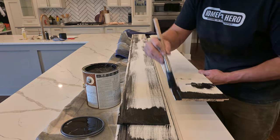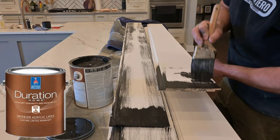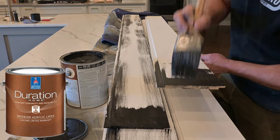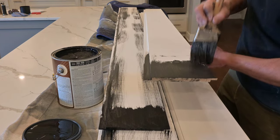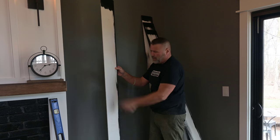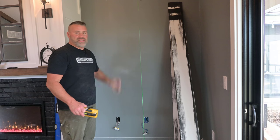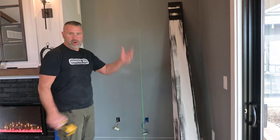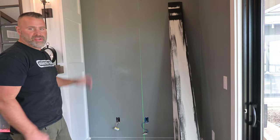I'm planning on hand-painting all the shiplap, so I'm making sure I get all the crevices and definitely the area of the board that actually touches the white ceiling. I'll get one coat on there so I don't have to be so picky on that second coat. On the first board, I put center marks on the shiplap boards both low and high, and I'll line the marks with the laser and work off both sides until we get to the corners. That will make sure the shiplap is even on both sides.